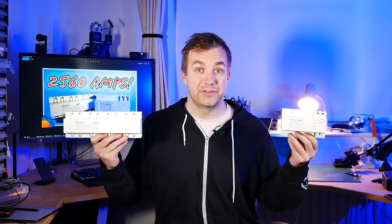The same protocol applies when changing settings or receiving information about power usage — and this is where the micro SD card slot comes in handy. With support for up to 32 GB cards, you'll be able to store up to 180 days of power usage history and query that history using HTTP calls from Sonoff DIY. That way you don't have to deploy your own database or cloud to store the data — if you're interested in up to 180 days of history, it's conveniently stored and served to you from the SD card itself.